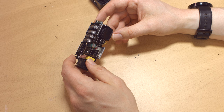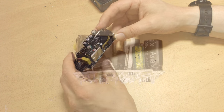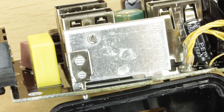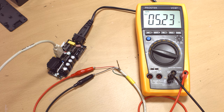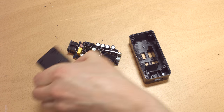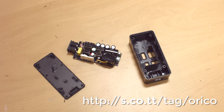Where that slot is not present, there is fairly good distance between the components on the order of about 6mm. All of the components are placed very square and true to the board, with the exception of the H17C optocoupler, which is at the end of the board at a severe angle, and its leads don't protrude all the way through their holes. On the upside, the heatsinks are tied independently to the board. Based on my initial testing and a fairly cursory look at the electronic components, this little USB power supply seems to be a great value at $10 US. I've put a few high quality macro images of the PCB on my site at s.co.tt.